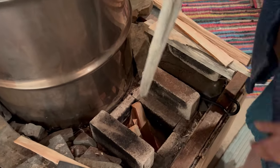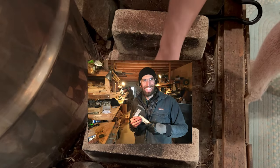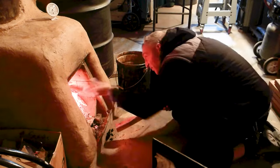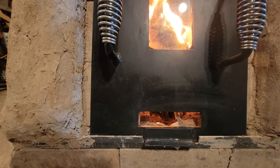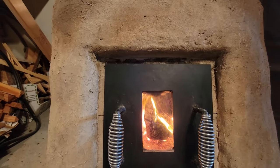Further, an 8-inch J-tube will be ample for keeping a home warm. But it'll take a couple of hours to heat a shop from stone cold in the middle of winter. An 8-inch batch box will burn 4.3 times more wood. So, 4.3 times more instant heat.